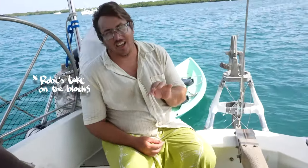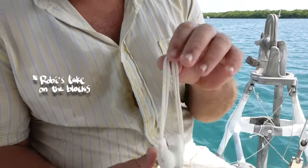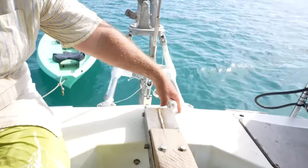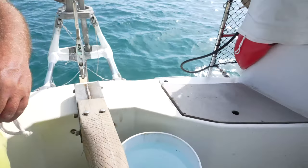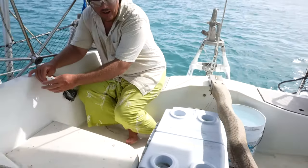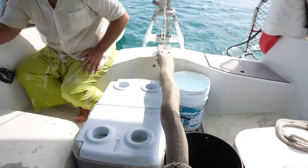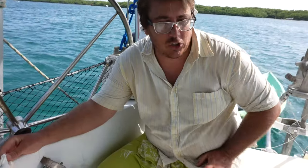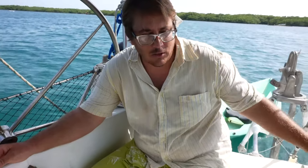The thing about the pulleys is that they are extremely chewable. One here, one there. We have to put stainless steel rings here or eye bolts or U-bolts. And then the ropes will cut across to each side, and then there'll be other ones over here. So that rope from that side will come to here, and it goes to the pulley, and it goes to here, where it'll be attached to the tiller. We're gonna have some crisscrossing ropes. I think they need to be crossed. I'm still not sure, but I'm pretty sure with the Aries wind vane, when it comes to tiller steering, the ropes need to be crisscrossed. If it's wheel steering, they don't crisscross, but if it's tiller steering, you have to cross the ropes over to steer.